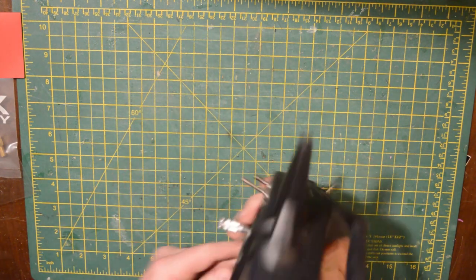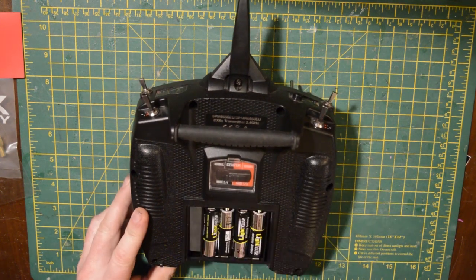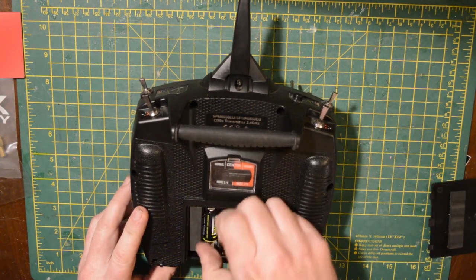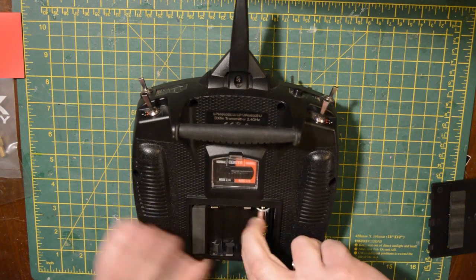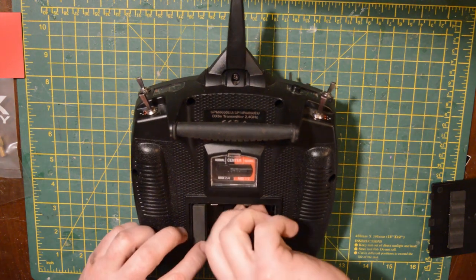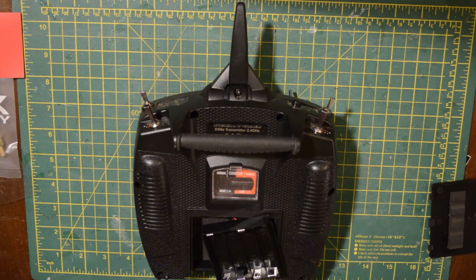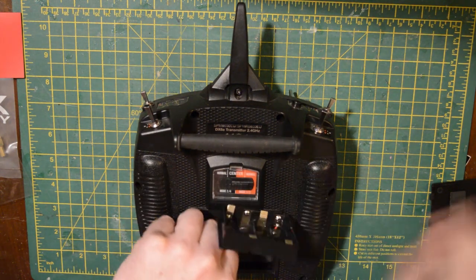What you want to start off by doing is removing your batteries, battery tray, any foam, little bits in there, any spacers or whatever. The actual tray itself just unplugs from the transmitter board inside. Just be very careful when you do this — don't force it and try not to break anything. It should come apart pretty easily as you'll see.